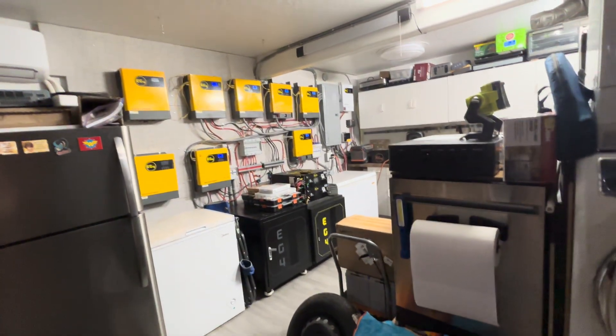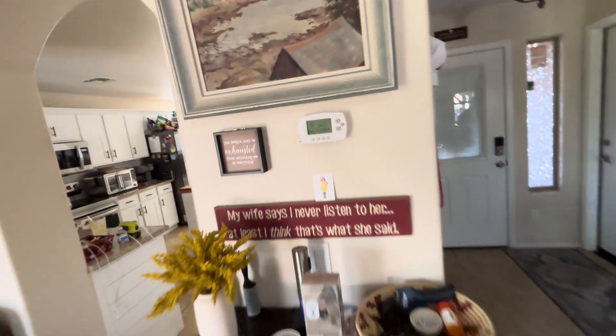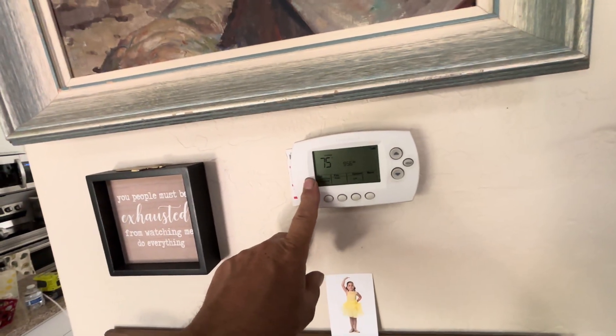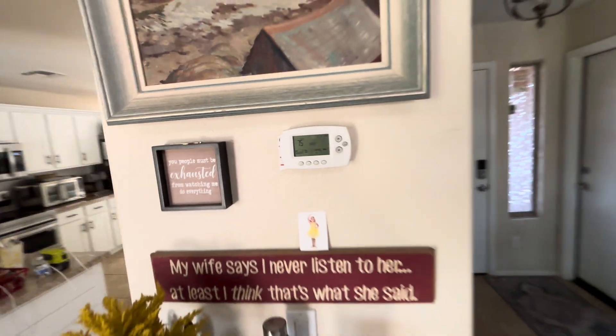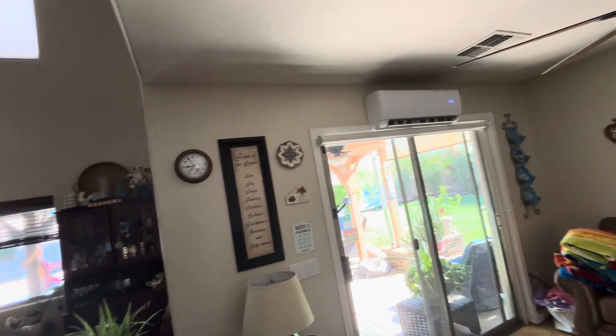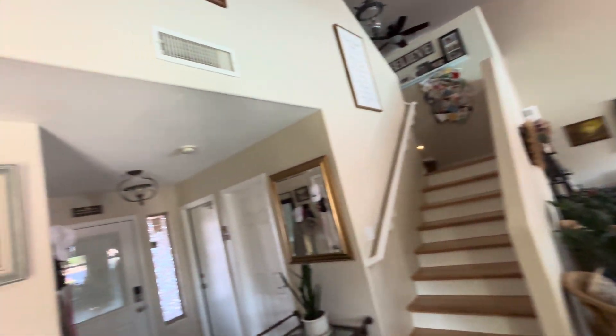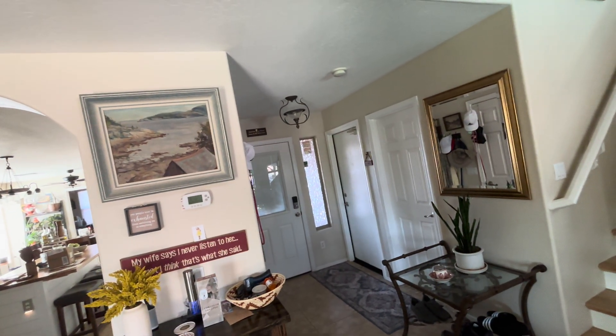That's the nice thing about running off-grid solar — you can actually set your temperatures. In here I'm running one mini-split on the off-grid and another one down there on the off-grid. But here's my thermostat for my four-ton — I can turn both of those off and run this off-grid as well. I can run my three-and-a-half ton upstairs and my four-ton downstairs if I really want to. But these two 12,000 BTU mini-splits do an excellent job and use half the watts of the four-ton, keeping it around 72 to 74 degrees for free.